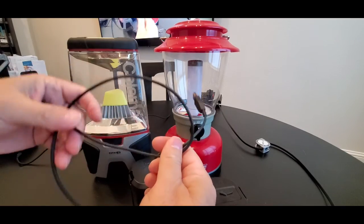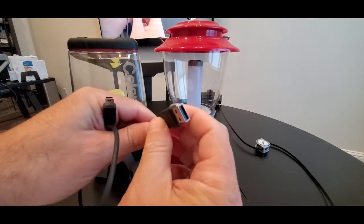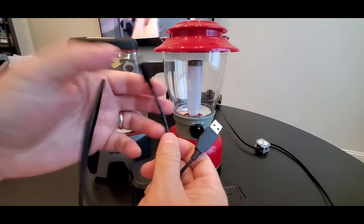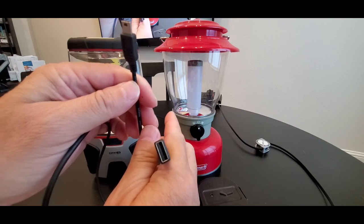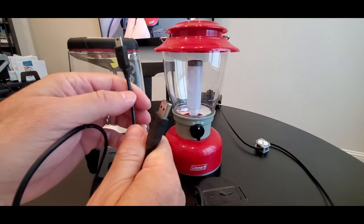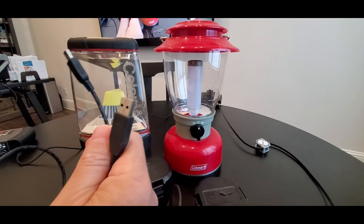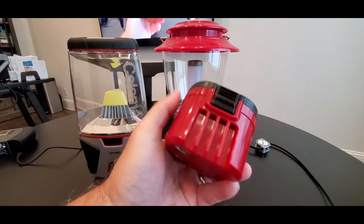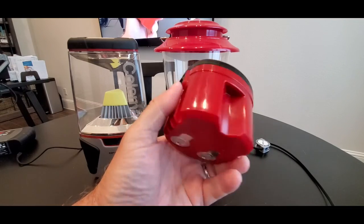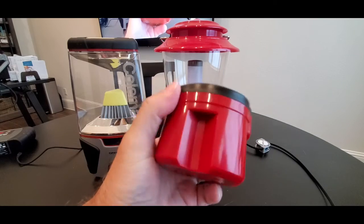For the conversion you are going to need a USB cable — the USB-A portion — and this can be any type. Use USB 2.0 because those are five volts, two amps, which will be perfect. You also need the old battery pack that you are going to cut so that you can modify it.